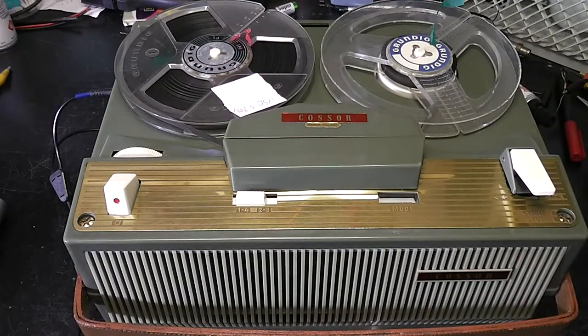Okay, so the fast forward and rewind is not perfect due to the big idler wheel having pot metal rot, and of course it's split, but it plays back fairly well. There's a fair bit of bass there, so it's not too bad. So it's not a bad repair, not up to full factory spec, but definitely more workable than it was before we started.